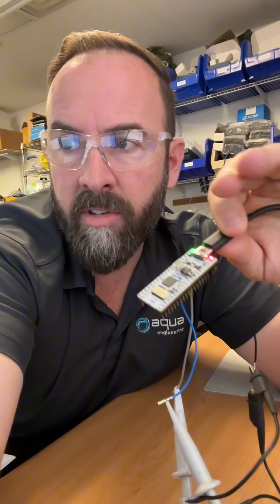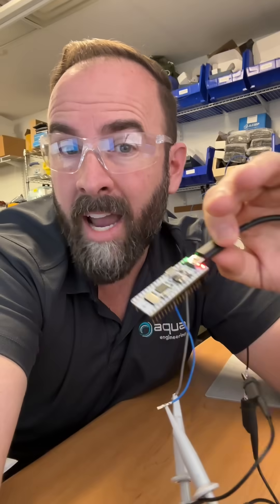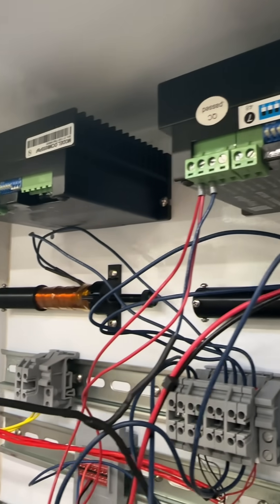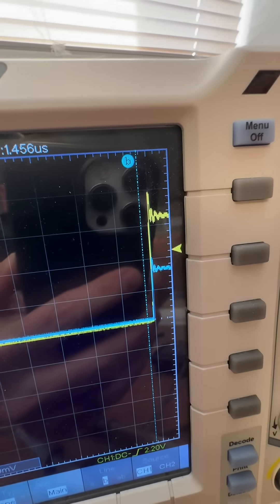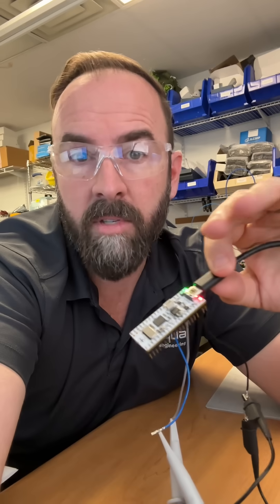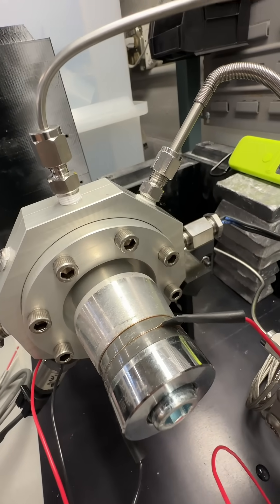What I've done is I originally just had a PWM 50% duty cycle giving me sine waves with my stepper drivers. That's my dirty way to brute force a sine wave from a square wave. I just had a fixed frequency, and I was getting some stable bubbles.